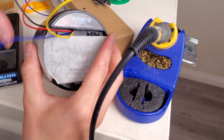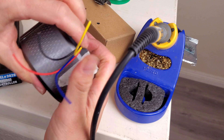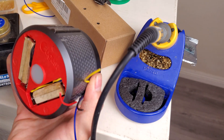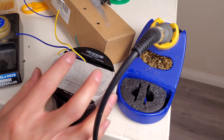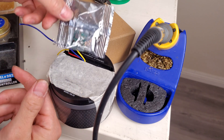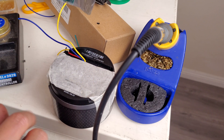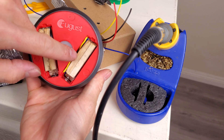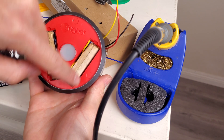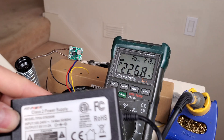At this point I have installed my two battery replacements with the positive and negative leads soldered onto the copper plates. Here are the four wires coming out, and they're going to go through this channel so there's space for it to mount to the door. I need to step down the voltage — I have a power supply giving about 7.6 volts and I need to step it down to 3 volts, feeding both of these to those independent channels. Remember: it's two double-A batteries, each 1.5 volts, so I need a total of 3 volts for both sides.